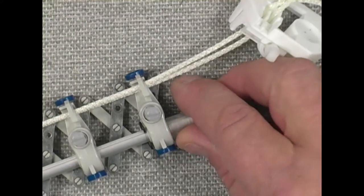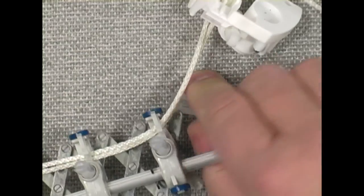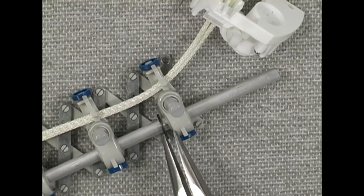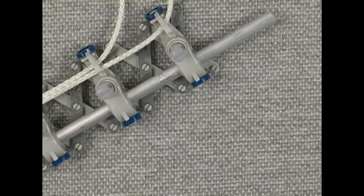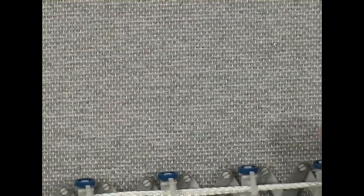That's the spacer there. I'm going to go ahead and remove my spacer. Just comes off. Just a little plastic guy. My C-clip here, I want to remove him. I'm going to take a pair of needle nose pliers to get that guy off. Don't want to damage that in any way. And on a carpet, this can be hard to see, so I want to stick all that stuff in my end cap over here. I've got my carriers out now.